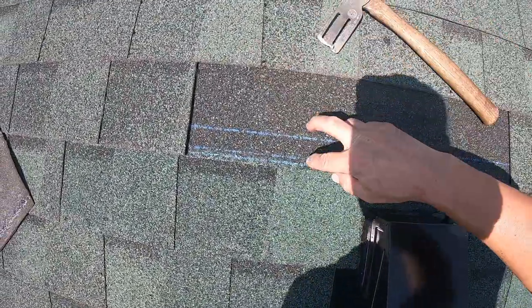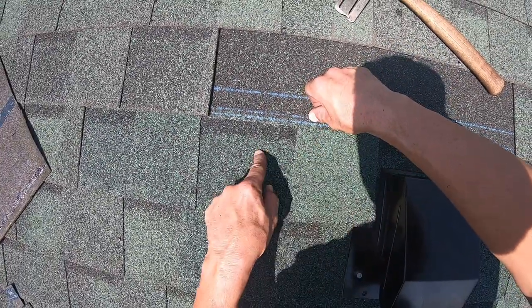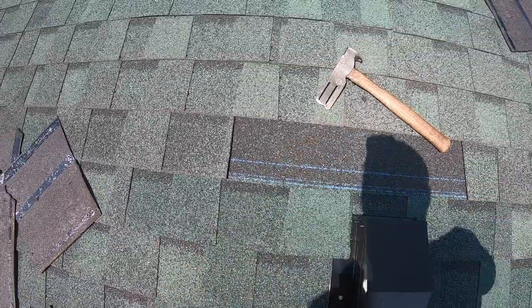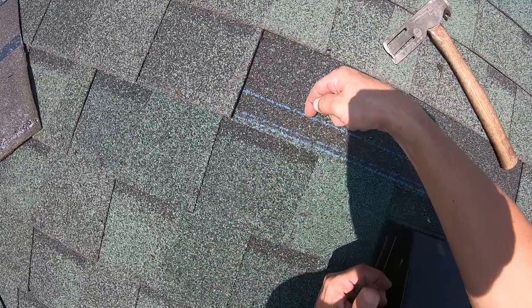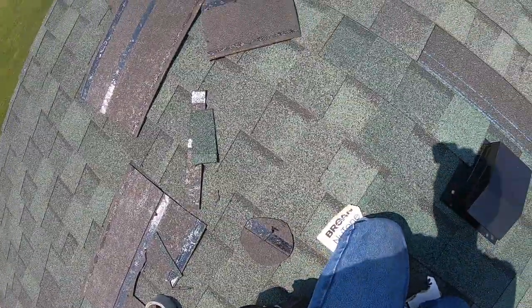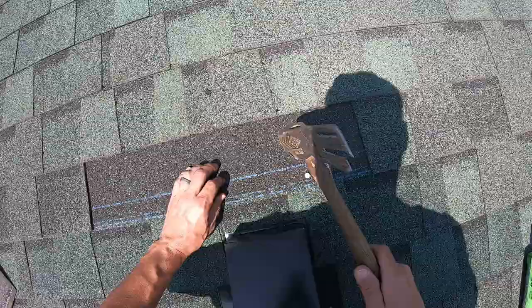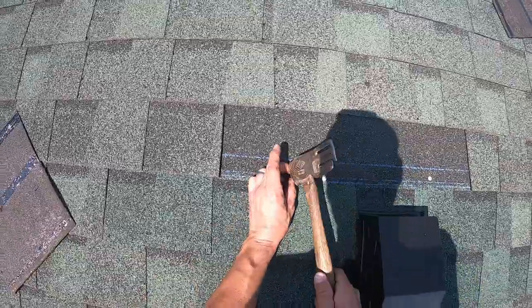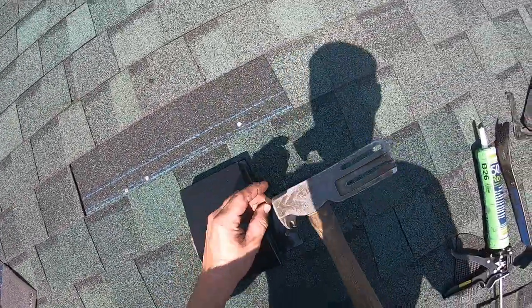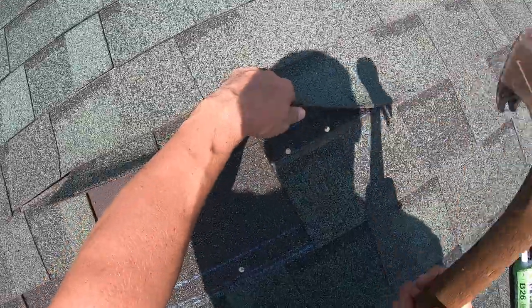Some shingle manufacturers give you nice lines showing where they want you to put the nail within that area. If you hit the double area, that's where you're actually getting the top and the laminate down below. Where some manufacturers, like Malarkey, have an inch-and-a-quarter tapered flange — so you're guaranteed to hit both. As for shingle brands: it doesn't matter if you have the best brand. If it's installed badly, it's not going to hold up.